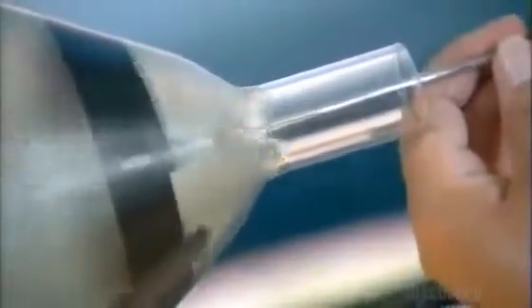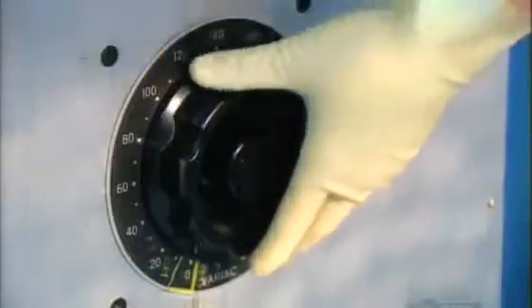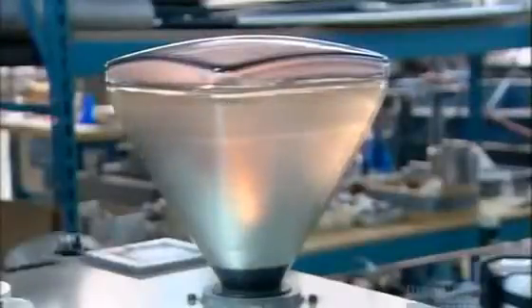The centrifugal force guarantees an even coat over the phosphor to protect it for the next step. A worker paints a conductive coating over the anode button, which will provide a flow path for the electrons that will light up the phosphor particles. Next, a worker drops an aluminum pellet into a tungsten coil, places the bulb over a vacuum device and draws out the air, then applies an electrical current to the coil. It evaporates the aluminum pellet, which spreads a mirror-like coating on the inside of the bulb. Now they heat the bulb to 218 degrees Celsius for one hour, which bakes out the lacquer and any trace of moisture.